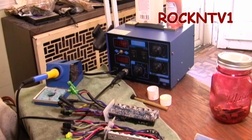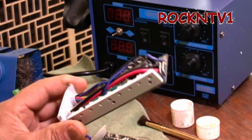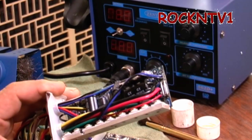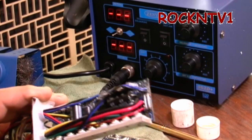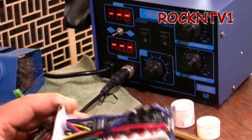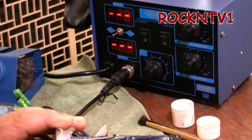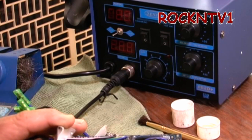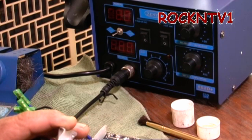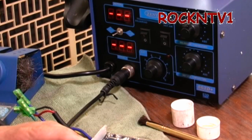I'm going to show you right now. This is a blown controller that is probably repairable with a couple of through-hole devices, and it's a 48-volt controller that with a very small modification would become a 36-volt controller. My bicycle is 36-volt and has the exact same board, so they can be made to run with a 48-volt battery — hot off the charger that could be 52 or 53 volts — which means capacitors on this board specced at only 50 volts are a problem. You should have 60 or 63-volt caps, but that's for another video.